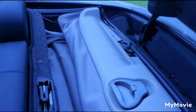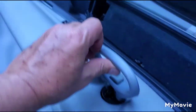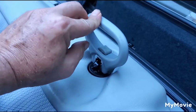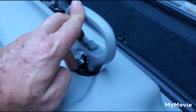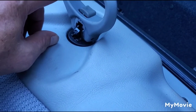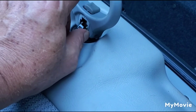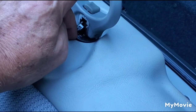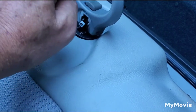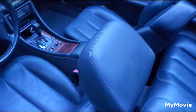It's a little tricky to put this handle back in. The best way to do it is, just as you see it, lower it all the way down. Then hold the handle by hand like this, press it all the way down — because this is spring-loaded. Turn it 90 degrees while holding it down from above, then stick the pin in there. I think it's like a 2.5 or 3mm pin. That's the only way the pin is going to fit in there, when this piece is pressed all the way down. Then you just secure it, and that's it. The top is fully operational now — the cables are installed.